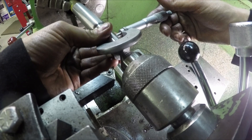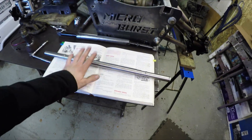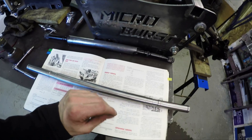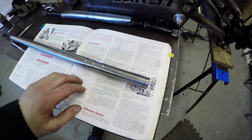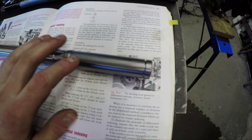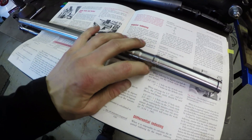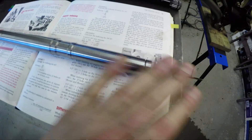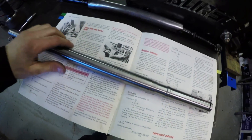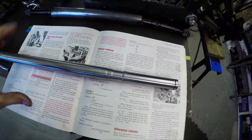It's still at 0.821, I'll let it cool down. Finished doing all the lathe work for these axle shafts and it turned out pretty nice. There it is - all machined down, same with the other side. Nice spot for the boot to sit in when you clamp it, and you've got the snap ring groove. Now what I need to do is put the splines on this axle shaft.